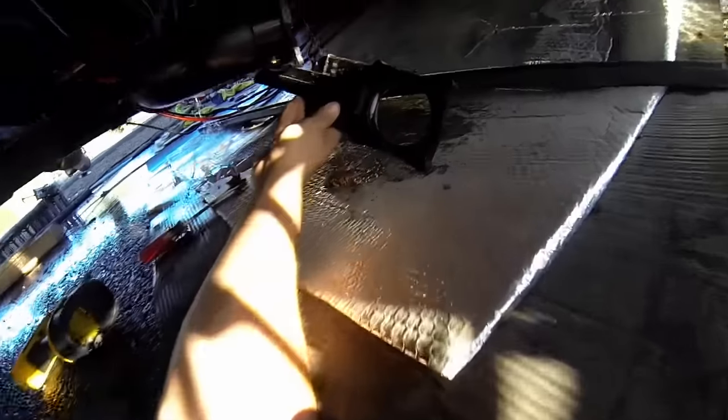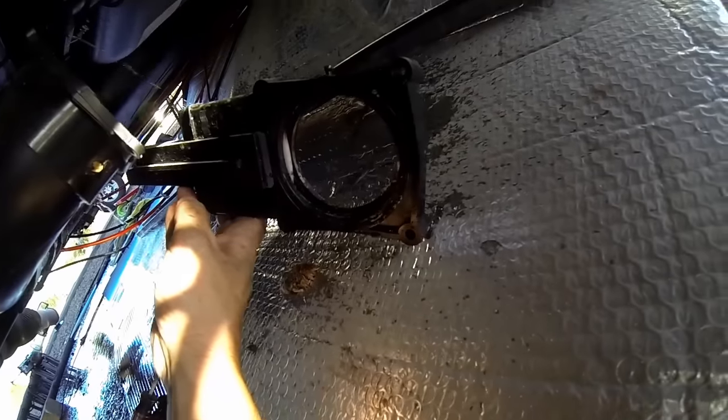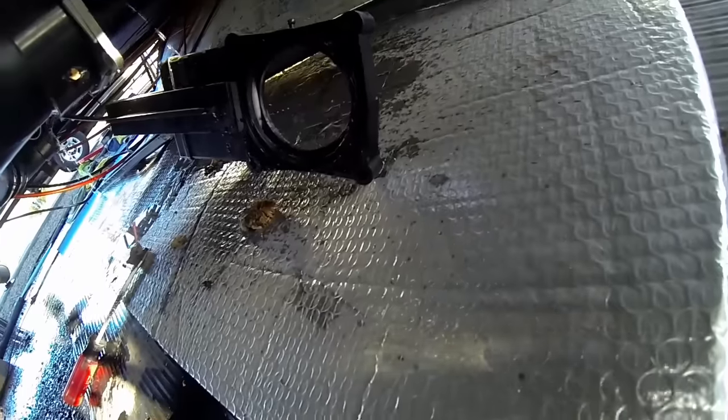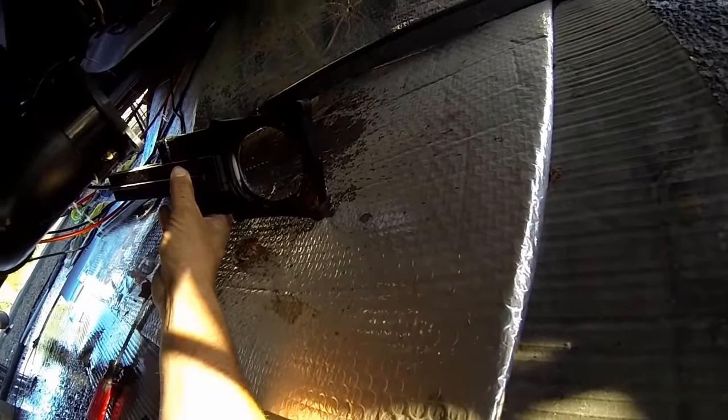You can actually see the top part of that white valve right here where my thumb's at, and that's the debris that was in there that got wedged in. I actually had to remove this rubber seal. What happens is, when it closes, if something is in the way at the time that you close the valve, it gets pushed down and wedged between these two rubber gaskets, and you actually have to dig it out. I'm going to have Rob go ahead and go over and close this valve, and I'll show him how it closes to make sure it closes all the way.